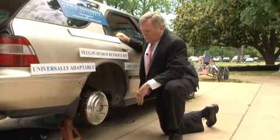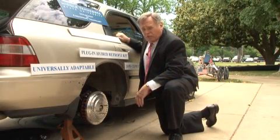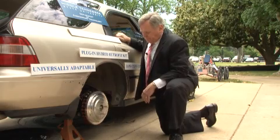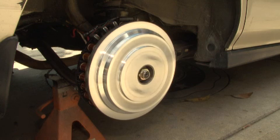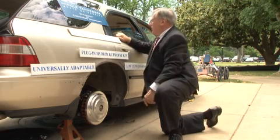There's one on each side of the car. I'm going to have the motor turned on now so you can see how it rotates. Go ahead and turn it on. This is in static operation. In actual operation, you start accelerating with the car, then the traction motors turn on and supplement or augment the traction provided by the gasoline engine, thereby reducing the amount of gasoline required. In actual operation, this system will double your mileage in town. Both sides are running and both sides are identical.